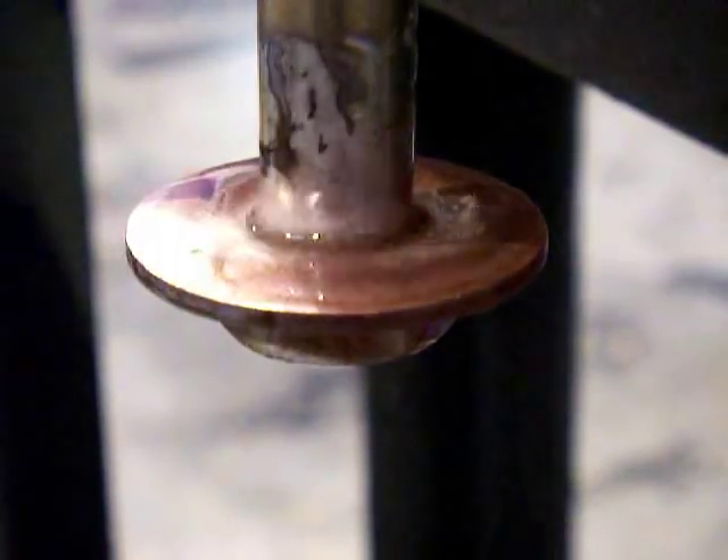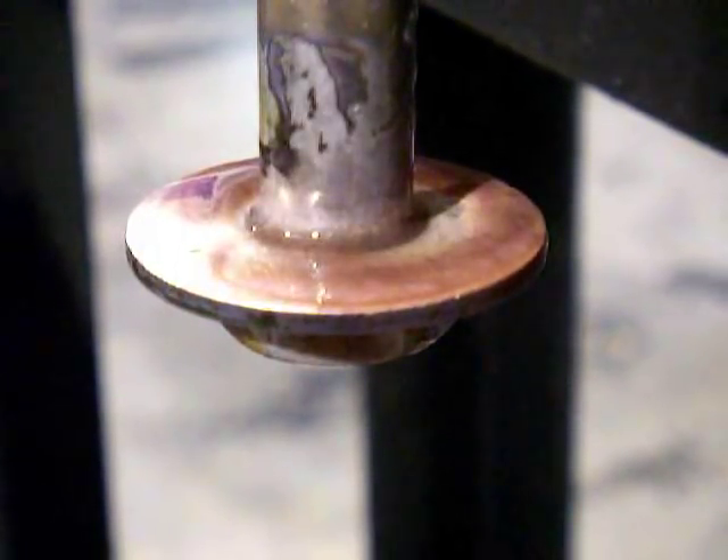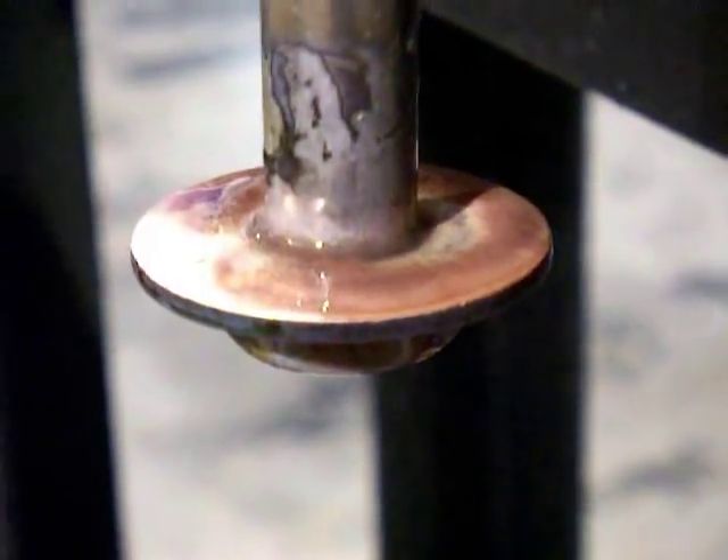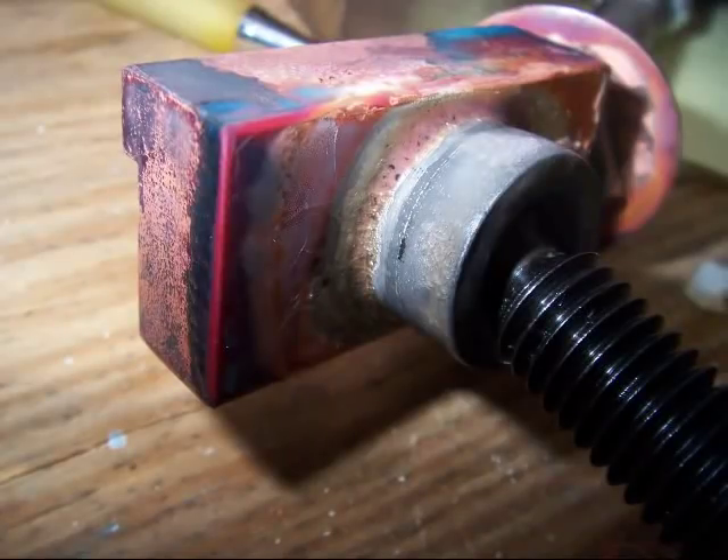We know we've got plenty of silver braze material flowed down into that joint. It works. If you've got something round or you can pre-cut the braze material and place it, sometimes it's better. You can see that collar that flowed all the way through to the head — you know it's good then. And there's a nice little fillet around the swivel pad.